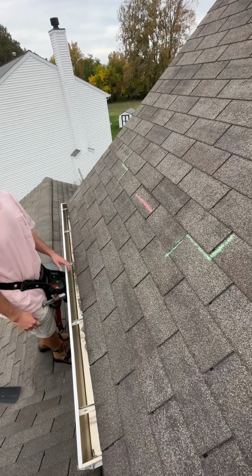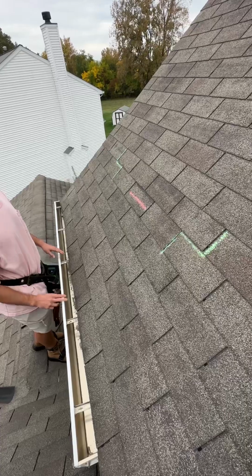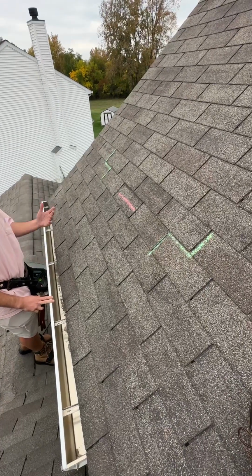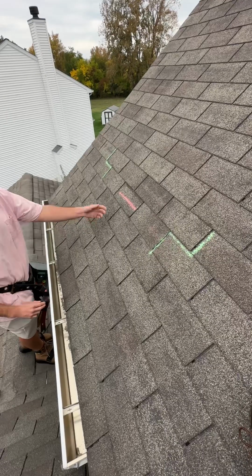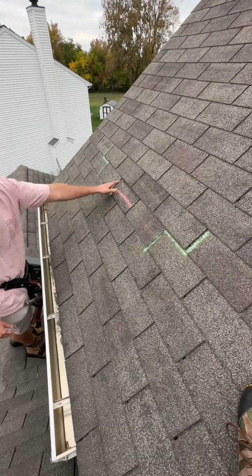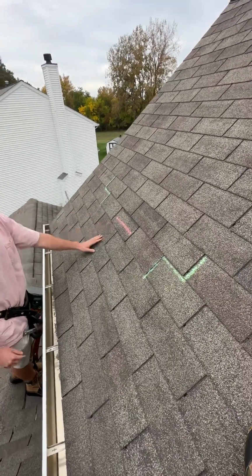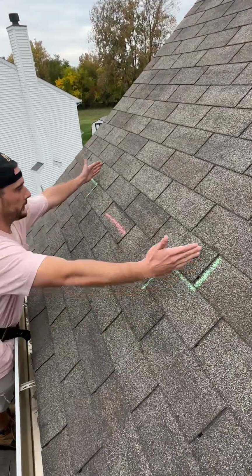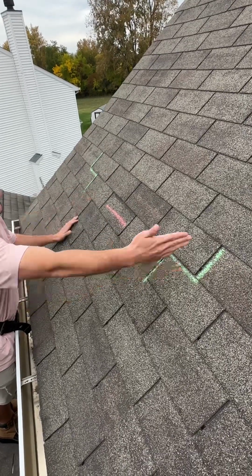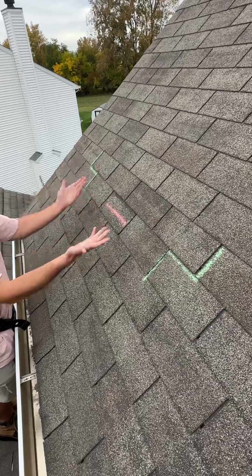I'm here on Jim and Lynn Chrisman's roof. We are here to do a repair to show the issues that we are coming across when doing a repair on the wind damage. As you can see here, we have our tab marked off, fracture across the neck of the shingle. I'll be working in this area, removing nails from these courses of shingles. That's what the green is, just marking off where my repair zone is.